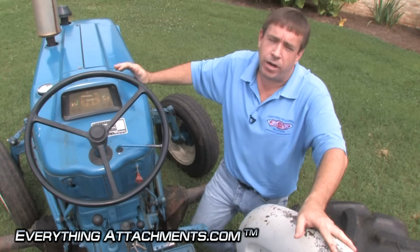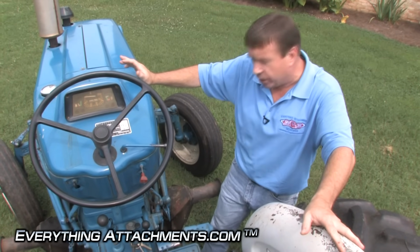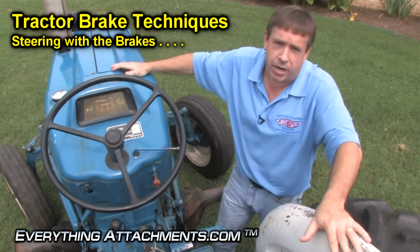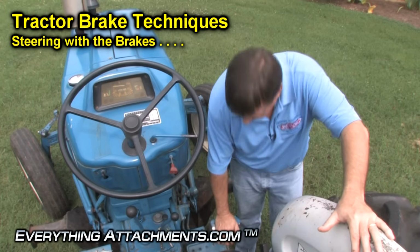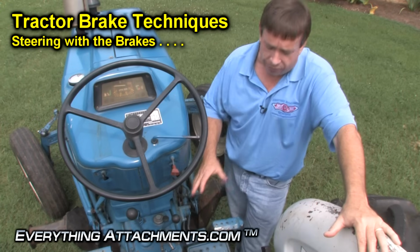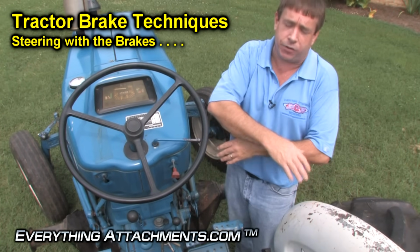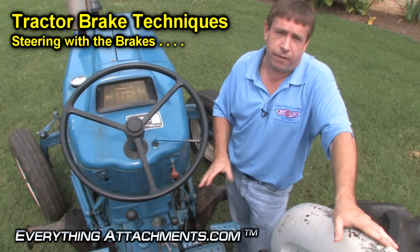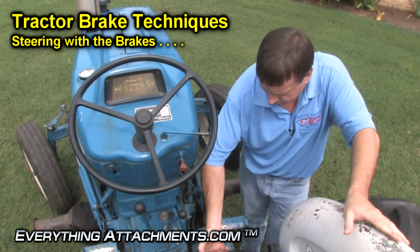On most of the new tractors today that are four-wheel drive compact tractors, you can't really steer a tractor with the brakes. In the older days, most every tractor was a two-wheel drive, and the brakes are independent here, can be totally operated independent. And in most cases, everybody used them to actually slide one tire to turn the whole tractor so it would turn really sharp. But you can't really do that in a four-wheel drive. It'll just kind of put it in a bind. So this is your brake lock up here.